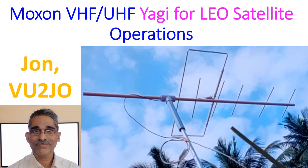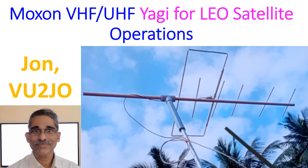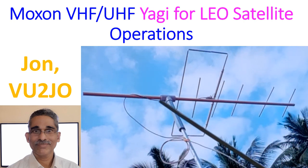When you are operating outdoors, you can rotate it to match the polarization of the antenna. But this is in a fixed position. You can see that the larger element in the shape of a rectangle is the Moxon rectangle element, used for VHF — that is why it is larger. And there are five UHF elements. All of these have been mounted on a PVC pipe surplus from electrical wiring.